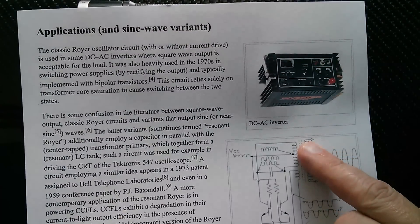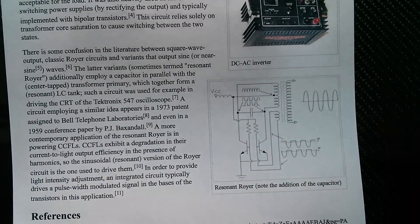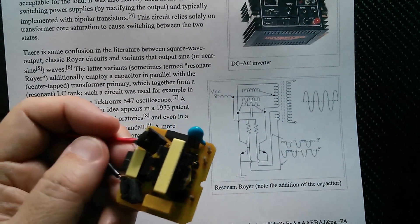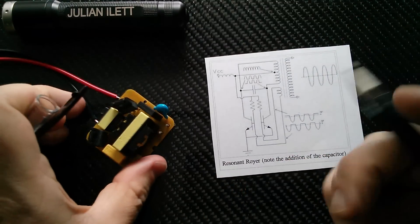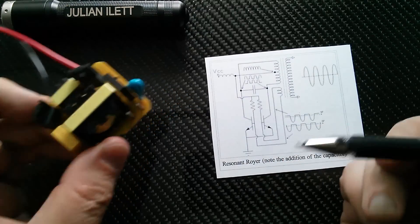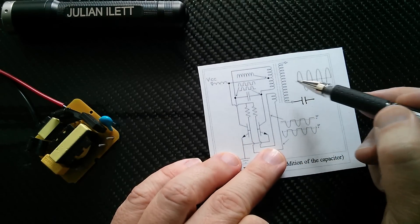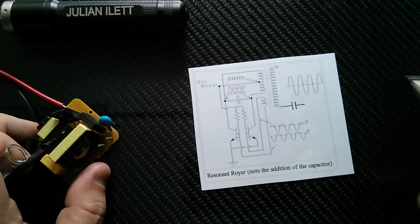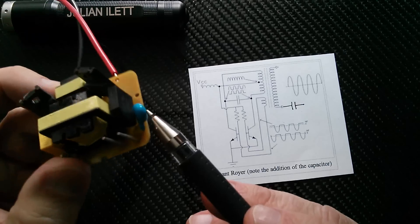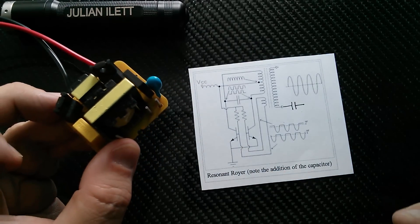I've printed that Wikipedia page out. Here's the diagram with the circuit and I will add on to this — I'll cut this out and add on the components that are on my board which seem to be in addition to this resonant Royer oscillator. The additional components are this blue thing which at first I thought was a MOV but now I'm pretty sure it's a capacitor — it's got 222 written on it. That's in one of the output arms of the secondary of the transformer, the high voltage side. And then there's also this bridge rectifier on the output of this circuit. So it turns low voltage DC into high voltage AC and then rectifies it to turn it into high voltage DC.